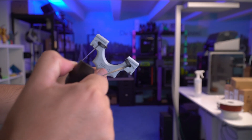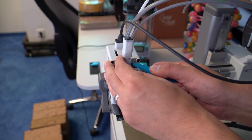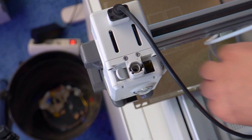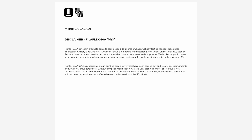The 60A performance was incredible - I didn't even have space to fully test it. Printing it was not easy, even for something this simple. I was trying to print on the A1, which is a good printer for flexible filament, but I couldn't even feed the filament into the extruder - there's a tiny hole where the PTFE meets the extruder body and I couldn't get it in, like putting a wet noodle in. Even pushing it into the PTFE tube is difficult, but pulling it out as the extruder would is hell because it just stretches. I had to print at 50mm/s. Recreus does not accept refunds if the filament doesn't work on your printer.